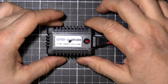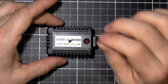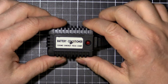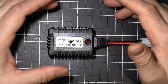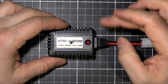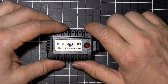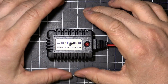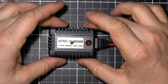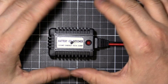The true memory effect is actually the growing of crystals inside the battery from precise charge and discharge rates, like what you'd find in a laboratory or in a satellite when they used to use nickel cadmiums. They were charging to millivolt values — that precise. You'll never get that in a battery drill or a remote control car. It was also a different battery chemistry — not a nickel cadmium like in your remote control car, but a different cadmium-based battery.